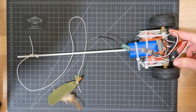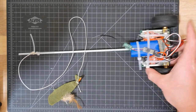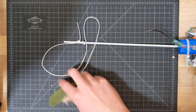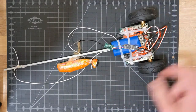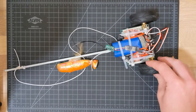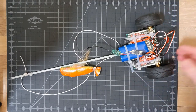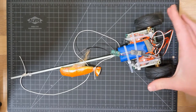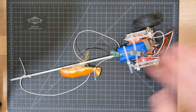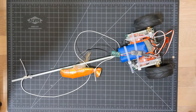It's got two wheels, each with its own motor, two motor speed controllers, and basically it drags around this stick and pulls a toy fish behind it, or some other cat toy of the day. This vehicle is a little unusual because it only has two wheels, it drags its tail, and it controls its direction and speed by differentially varying the speeds of these gear motors. I'll do a video later about the finished version of this toy and what I learned.